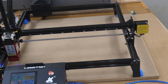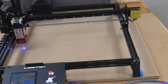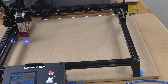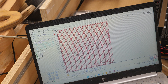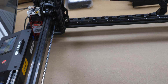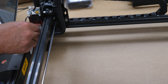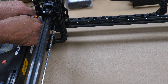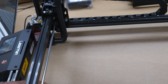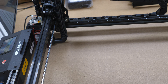I haven't focused this yet — I left it up high on purpose. I'll focus it before we get going on the actual engrave. By having it way up in the air like that it lets me follow the dot. You can also follow the process in LaserGRBL by watching the little blue cursor — right now it's moving down the right-hand side, showing the laser head position. To set focus, we're going to be engraving right on the base, so that's where I need to set my focus distance. I'll lay my focus plate down right on the base, then put the little thumb screw back. Now we are focused. I'll home this again just to make sure I didn't move anything, and then we'll start it.